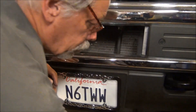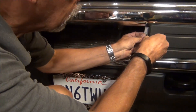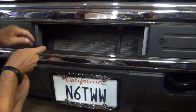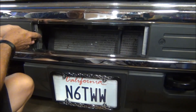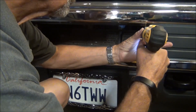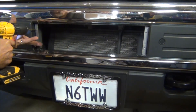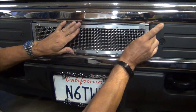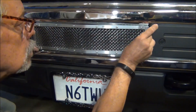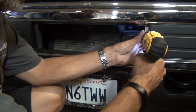I've marked where the screws are going to go in for the grill. I need to drill a hole here, so it's center punched where it's going to be. It looks like I'm going to have to open those holes up just a little bit more, so I'm going to get a bigger drill bit and just open these holes up a little bit more.